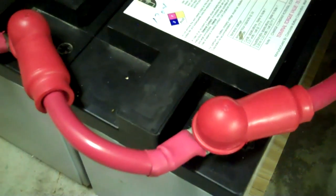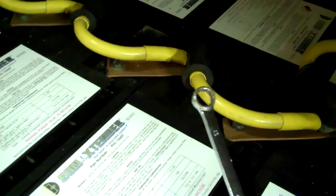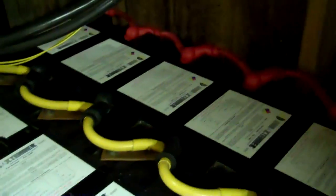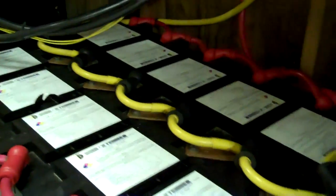When hooking your battery bank together, it really doesn't matter what size it is — the bigger the more dangerous. But when you involve your steel wrench in there, you really want to have your thinking cap on, because if you short one of these things out with a steel wrench it's going to be pretty exciting. Once it's all hooked together you'll be good to go. On a battery bank you want to pull your negative from one end and your positive from the other end. So I need to go into the upper cabinet and get that connection made first, and my batteries will be last. This is an AGM battery bank, and the 24 volt one is a lead acid — that's why I've got a gasket going around the hole in the very top of the battery box, going out to my solar fan which takes care of the gas. These AGMs are totally sealed, so even if they went under water they'd discharge a little from the water, but they'd be fine.